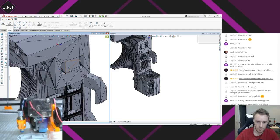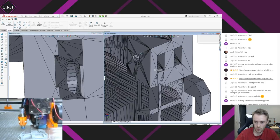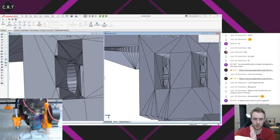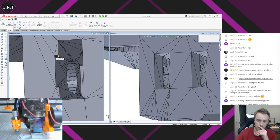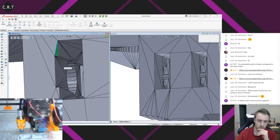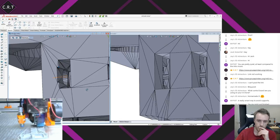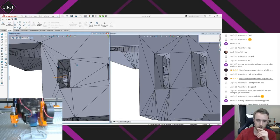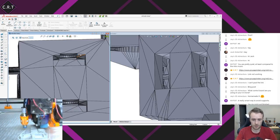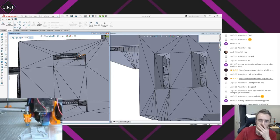Moving up, again, you can see this where they put the effort into the holes. So these are typically square nut holes. You can see they did them one way, and now they've switched to doing it the other way. Not sure why, because that is just going to be a bridge to nowhere. That point there, as you print this way, that's going to be really strange. Because on this layer, where you're printing that face, it's just going to be printing out into nothing. It's going to come out and just go across, and that whole corner is just going to fall. That doesn't seem wise.